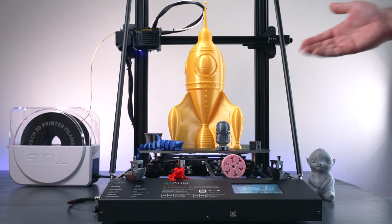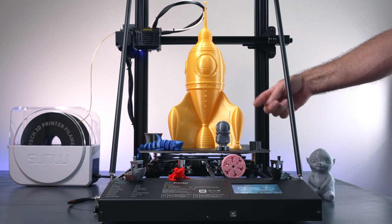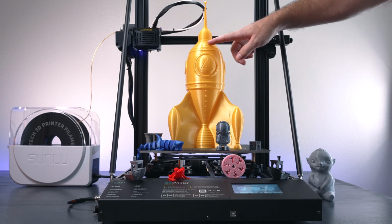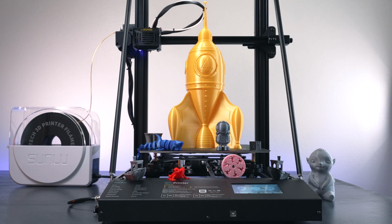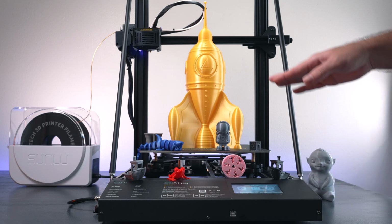Now for this last print, we have Spiralized Mode, which is a few layers on the bottom and then 1 layer all around to the very top. So it did very good until it got to about right here. And because this is Spiralized Mode, once past the first few layers, it counts the last layer that's all the way around to the top as 1 layer. And the problem with that is the buffer fills up very quick and eventually it starts to stutter.